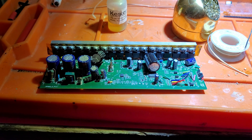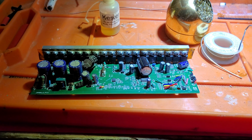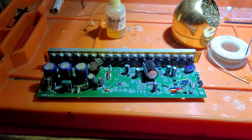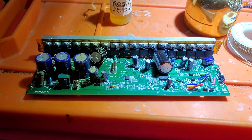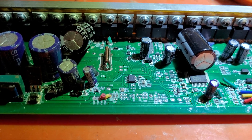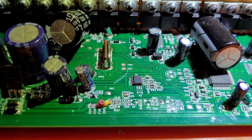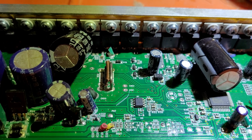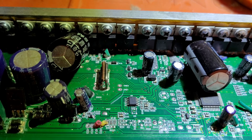Typically, e-bike controllers are designed for one part, and so they will derate a controller to fit a certain power requirement. One way you can get around that is by adding either solder material between those two shunt posts, or an actual piece of wire — that's my preferred method.